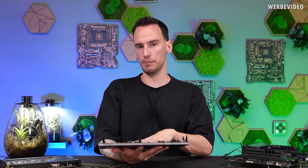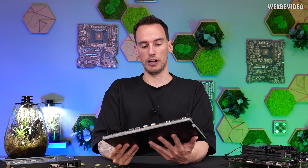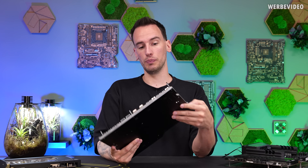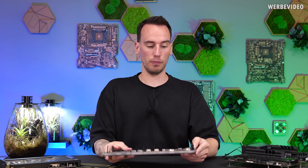Initially we just made the PCB with connectors and features, which worked, but the problem I realized was that putting it on a mouse pad or desk would scratch everything. All the pins going through from fan headers and the 6-pin connector go through the PCB — you can't just put it on the desk, everything gets scratched and looks terrible. So I added an acrylic layer underneath to mitigate the problem of pins hitting the desk.